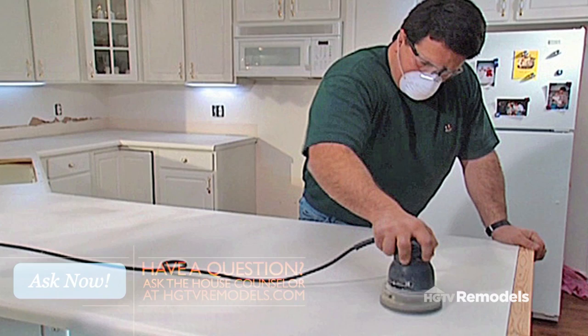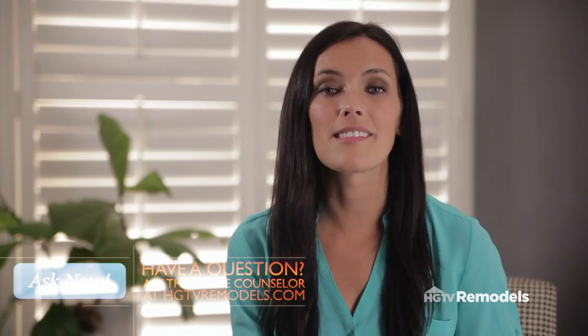The first thing you want to do is scrub your old backsplash with a grease removing cleaner really, really well. Next, dry it completely and apply some elbow grease — you're gonna need to sand that thing down. I recommend using a palm sander and a 50 to 80 grit sandpaper to get this job done right. The reason we want to sand it well is so that your new adhesive has something to stick onto when it's applied.